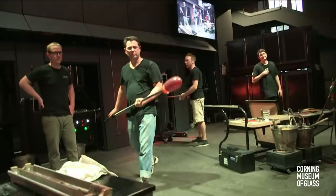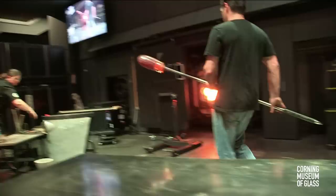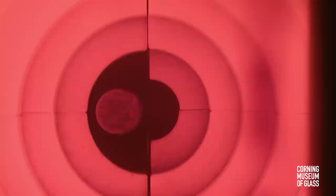That's how our glass starts out. We get our glass from a company called Spectrum, and they make cullet. So they mix all the batch, sand or pure silica, soda ash, and limestone, and then they melt it, and it's processed. I see that you got your hand up. I'll be right with you. It's processed, melted, chopped into little pieces, and then we get those little chunks and throw them in our furnace. It's a lot cleaner than using the silica flour. What's that? Similar to that, but they're not processed like that. They don't have all the color patterns. They're just little chunks, and we shove them into our furnace. It melts right down. What's your question?